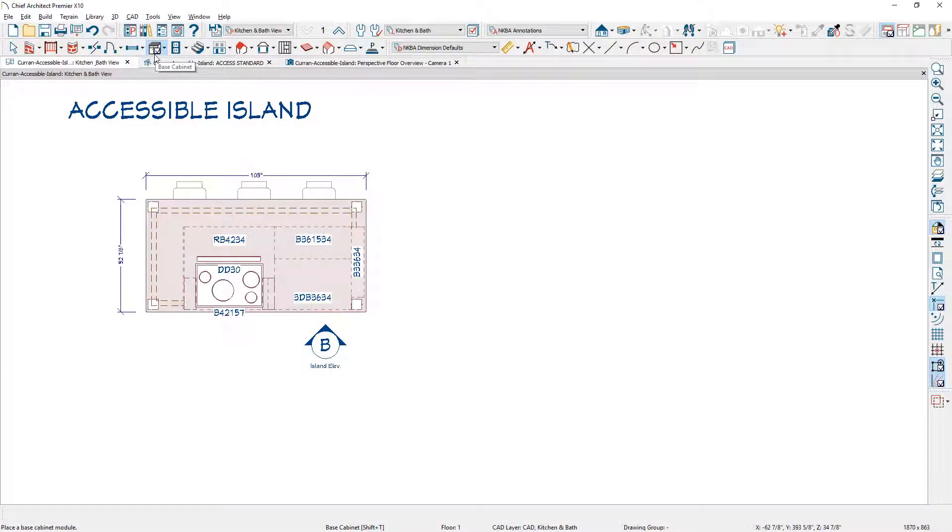As I build the island, I'm going to build it right next to the completed island you can see in the plan view on the left side of the screen. I'll begin by placing a few base cabinets off to the right, then resize them and evolve the island. The first base cabinet I place is going to be 34 inches high — all of the cabinets will be 34 inches high for the island.